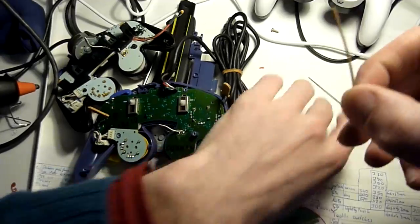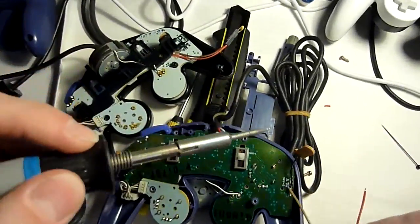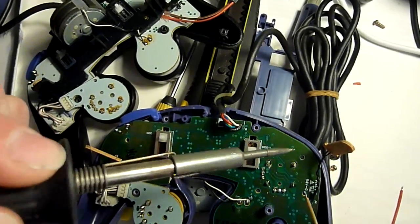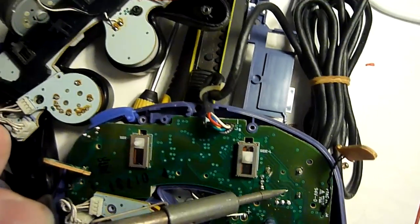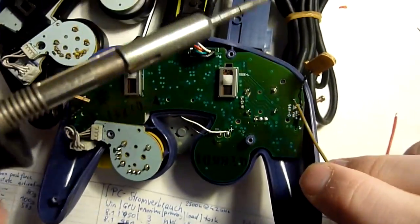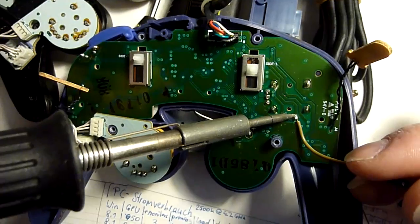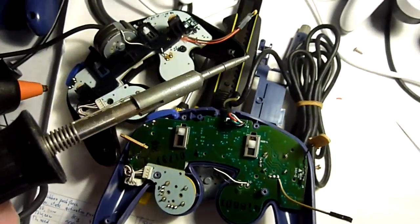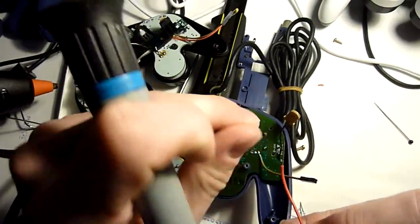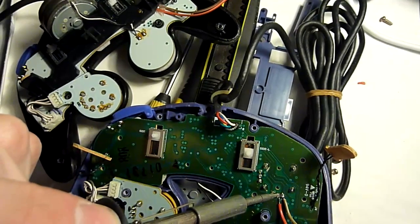So first we solder the darker wire, here it's brown, to the 3rd pin, the negative pin. And we do this by holding the soldering iron to pin 3 until the solder goes all liquid. And then we hold the wire to it, until there's good contact. Then we solder the red wire to pin 2, the signal pin.